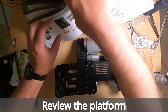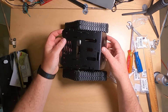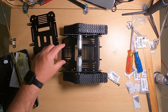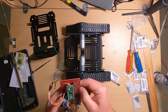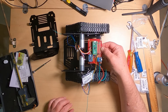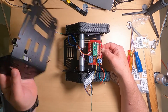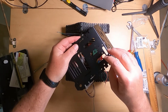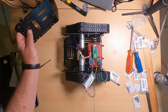This is all built up now. I've got some work to do to work out how to organize things inside there. This is the top that goes over the top. I need to find out where and what sort of battery to fit in - it'll probably be some sort of LiPo battery at 11.1 volts. I'll have a voltage converter to drop it down to 5 volts to power some of these things and the Raspberry Pi on top. I'll make a little tray - motor controller and power on that layer, and on top we'll have the Raspberry Pi and maybe a camera.